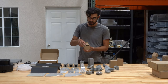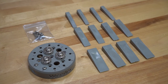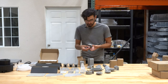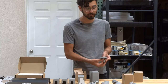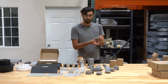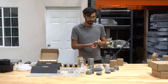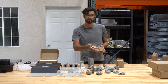Next up is the weeding tool. The upper portion has the magnets and the tool verification link. In the box are some small M3 screws as well as a variety of weeder blades in different sizes. Using the M3 screws, you attach these blades in any pattern you want onto the bottom of the weeding tool. The FarmBot can use this tool to push small infant weeds back into the ground, disrupting the fragile root system repeatedly over a couple of days. It's a proactive weeding technique — get rid of weeds before they become a big problem. For softer or sandier soil, use more blades; for harder soil, use just a single blade.